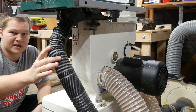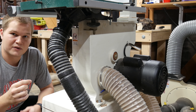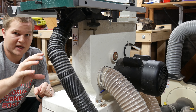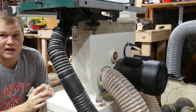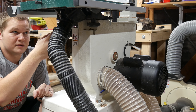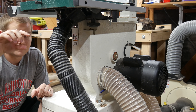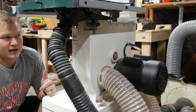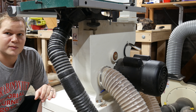I bought a semi-rigid hose — the kind with a makeup like bendy straws — that holds itself in position once you manipulate it. It's also taped at the top. It's easy to pop right out if I need to adjust the blade guides after installing a new blade, and then I just put a new piece of tape on. That only happens as often as you change a blade.